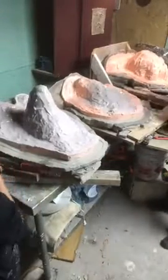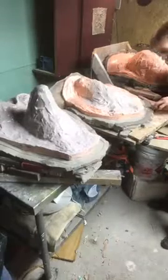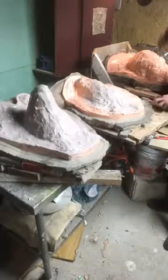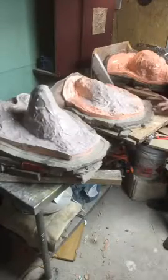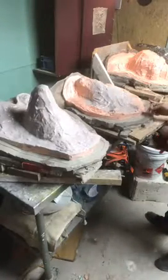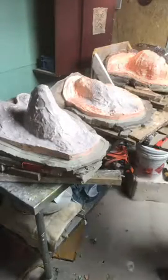Let me switch over so you guys see this second one that I'm working on. I'm just going on this one and rebuilding a bit of my mold wall and getting it prepped up, ready for glass. So like I started, I'm going to make sure I'm at least a good 2 inches around. Making it wider is not really a problem. Doesn't take a whole lot more fiberglass. Definitely makes the mold a little easier to carry, handle, gives you much better spots for when you're putting bolts in to screw them together. So you really want the width. More than 3 inches is kind of ridiculous in my book. Unless you have a super huge mold, then you really want a much wider realm to hold on to. For the heads, 2-3 inches is more than good. Alright.